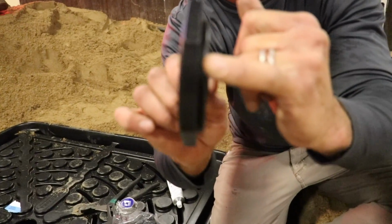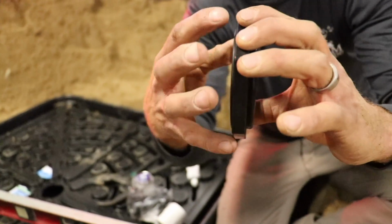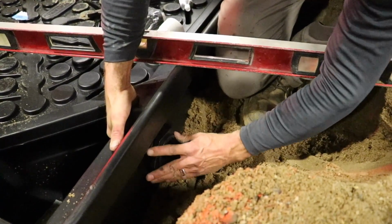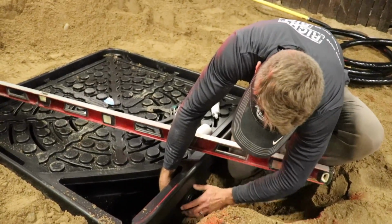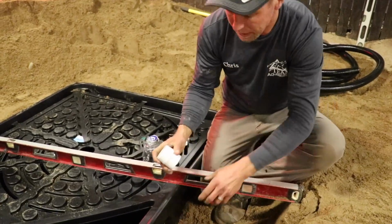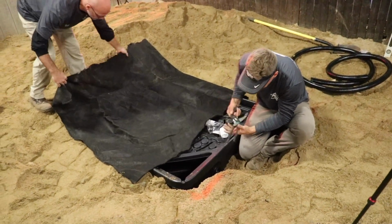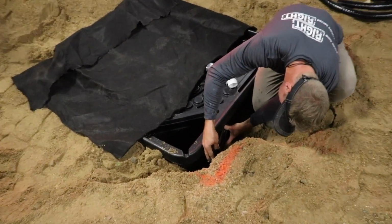See, this is a little bit thicker. I always put this on the outside, right? So as I'm tightening, this will be the side that's going to attach in here. Now this is a reverse thread fitting, so it's not like your normal righty-tighty, lefty-loosey. The reason for that is that when I am threading in this MPT, it's not going to loosen up that collar nut, because I'm actually going to thread that to the right. I get this as hand tight as possible, and then I'm going to come in and go anywhere from 1/4 to a 1/2 turn with my channel locks.